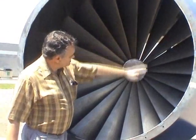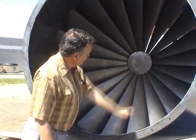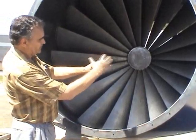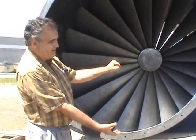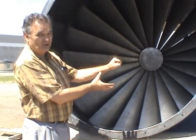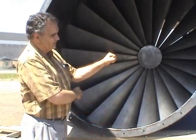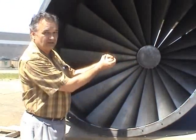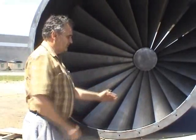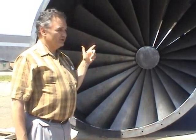What we do is spin this air very violently. So here's your spark again, going around really rapidly. By doing that, we break away that envelope of hot air — it takes away the oxygen, so this spark is no longer fed. It has to go out. Immediately it gets attacked by cold air that's surrounding this envelope. Take the envelope away, the cold air comes to it, and this thing cannot reignite again. So when it leaves this device, there are no more sparks or embers.